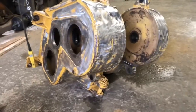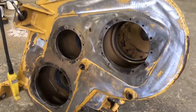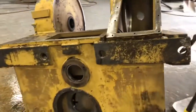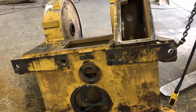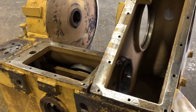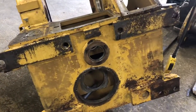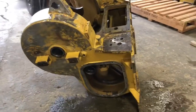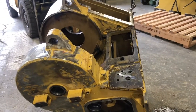So we've got to figure out a better way to fix that. The winch has been out in the cleaning bay, everything's been stripped, nothing left inside. A lot of the hard parts for these winches — gears, shafts, all that kind of stuff — are no longer available from Cat. Most of the stuff we were able to get in terms of soft parts, O-rings, seals. When it comes to hard parts, we end up pulling parts out of the boneyard and making everything else just work. Here's a quick snap of pre-assembly.